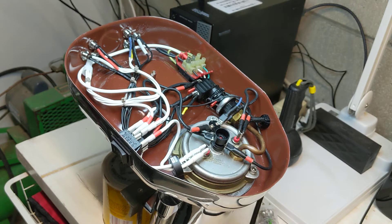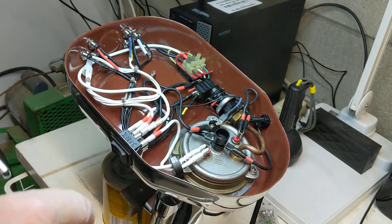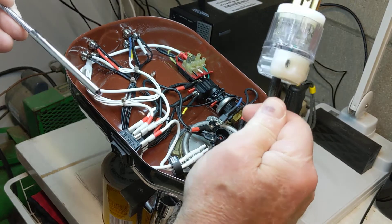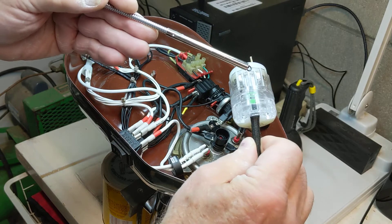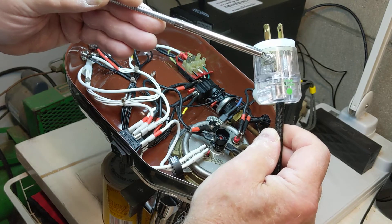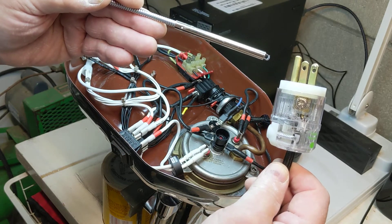I'm going to explain how my wiring is done on my upgraded machine. I'll take you through the 110 power first, then the indicator lights. I've replaced the plug with an industrial hospital plug that has a little light inside — when it's green it shows I'm getting power to the circuit. The breaker in the panel is on, and this is an American wiring system at 110 volts where polarity is maintained.